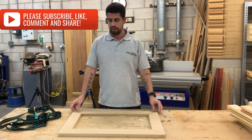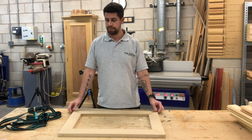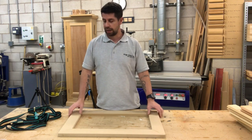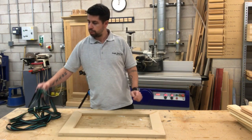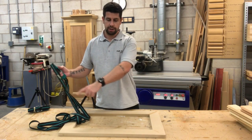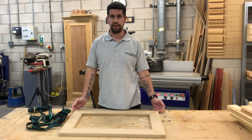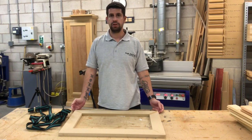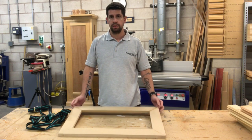It's really quite simple. If you try to use traditional clamps like a sash clamp or a bar clamp, the mitres tend to slide past each other. But if you use a normal ratchet strap, it puts even pressure all the way round, keeps your mitres together, and if they're cut accurately it'll keep it square as well.